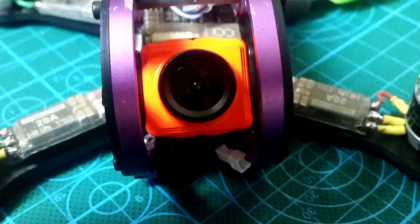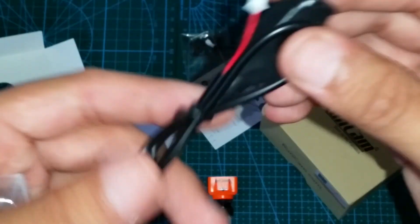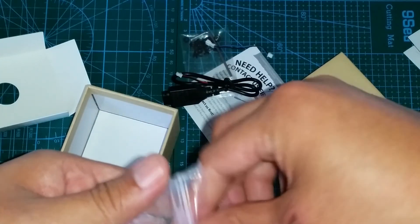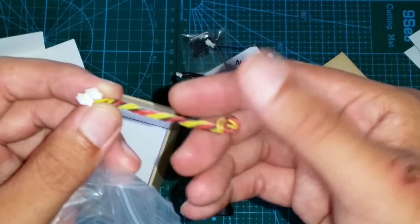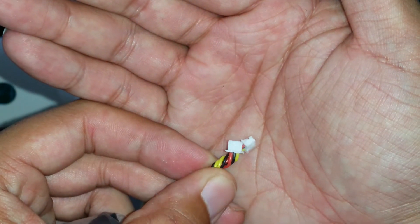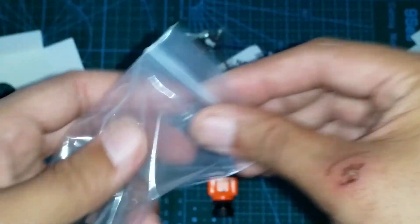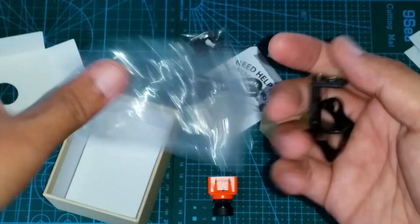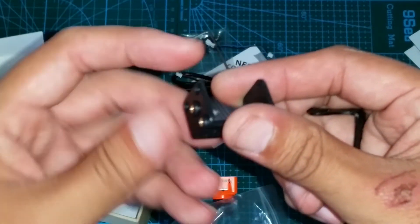Here's where I have mine placed. Here is the OSD joystick — it's used to modify the camera settings. There's a 3-pin to 3-pin connector; I cut this in half and soldered the other end to my flight controller. And lastly, depending on what your frame requires, you'll either use the mount with the mini or the adapter with the mini. You wouldn't use both.